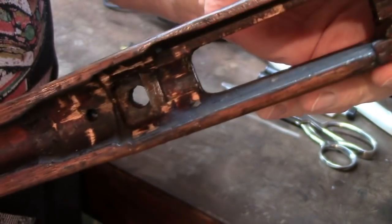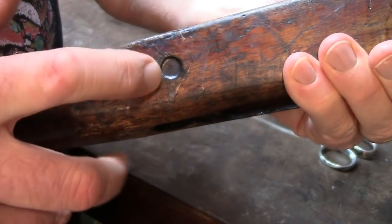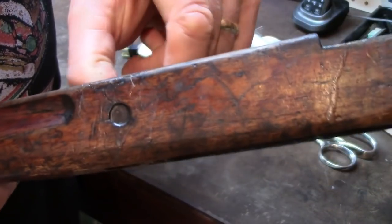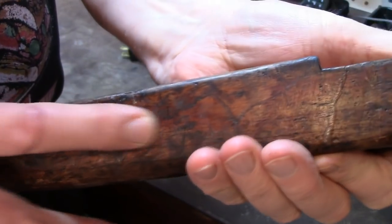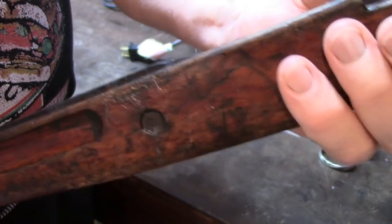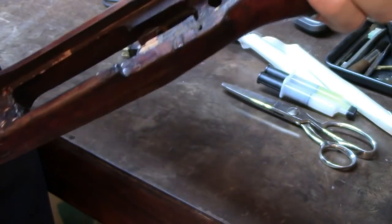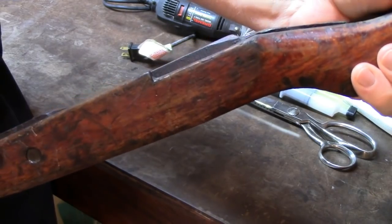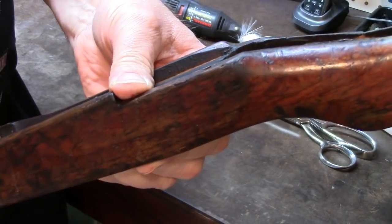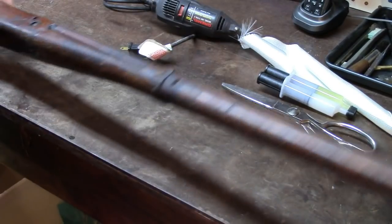The break in that stock went essentially through the forward section right here at this recoil lug, and everything behind it is where any degree of compression is going to take place upon the fresh wood. There's no issue of any tearing, pulling, or compressing of the fibers that would violate it. This stock — I could literally twist it when I first started; the fibers could be splayed apart. It was a completely failed piece of wood. It is now back to its original strength.